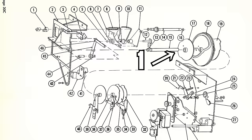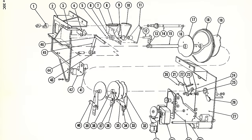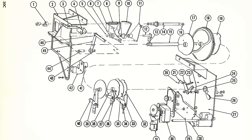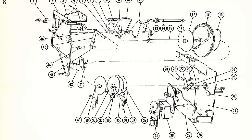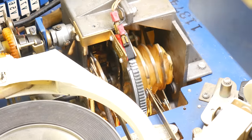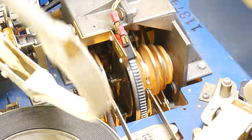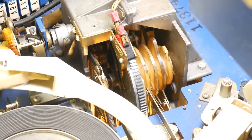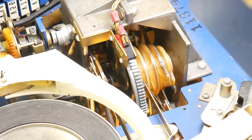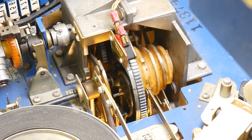There are seven cams in total, though that's not perfectly true, as you'll see later, but anyway, these seven cams are the programming of the physical actions that take place. Their shape and position dictate at what points in the mechanism's 360-degree rotation each action will occur. This may not look like a program, but it very much is. Note that the cams could be made to cause one action to happen multiple times per cycle, if required.